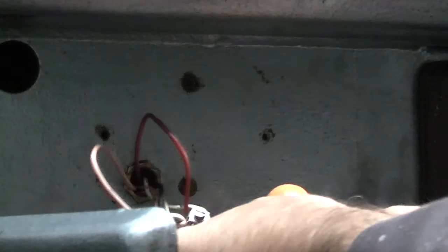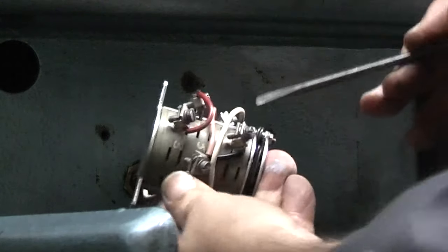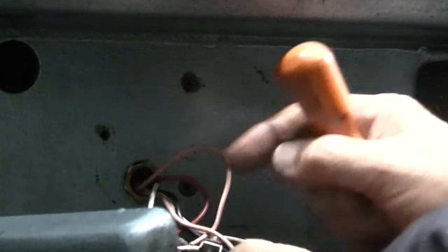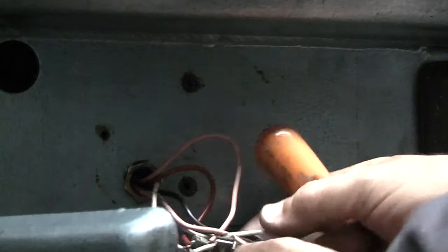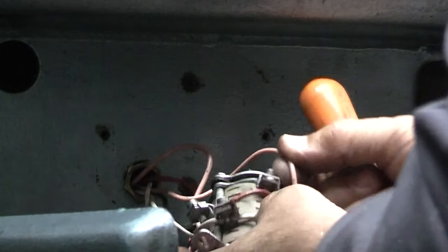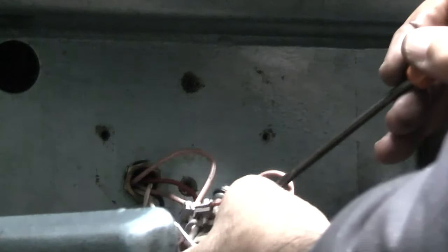First of all, before I take anything else off, I want to trace where the wires go to. It goes under there for some reason, but it's not attached. Into the lathe. Then we have a pink cable onto terminal 5, another white cable onto terminal 2. The red wire goes to terminal 4 and the black wire goes to terminal 1. And there's a link from terminal 5 to, so this one's not numbered on the top, but it's got a link in from the pink terminal 5, black that goes to this terminal on the top.